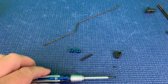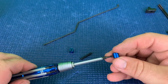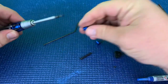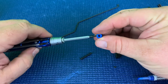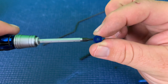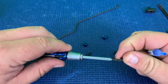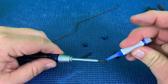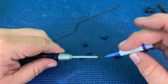We're going to start by putting some blue Loctite onto our set screws or grub screws and go ahead and just get these started into the collars. We'll use just a little bit — just run that in there until you can just start to see the thread go through, then back it off one. We'll do that for both of them. Once again, this is a 1.5 millimeter Allen wrench — just a little bit of Loctite, spread it around.